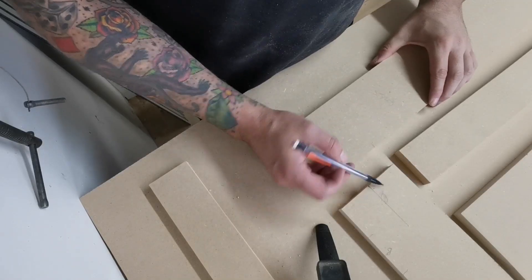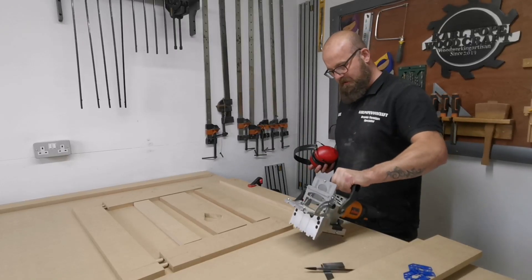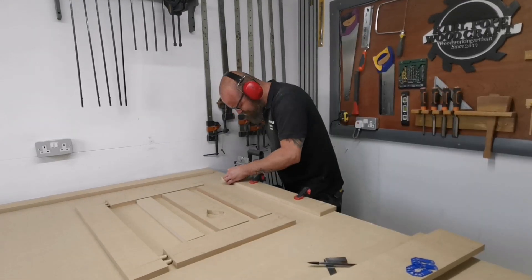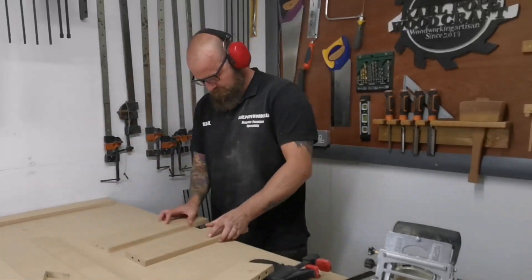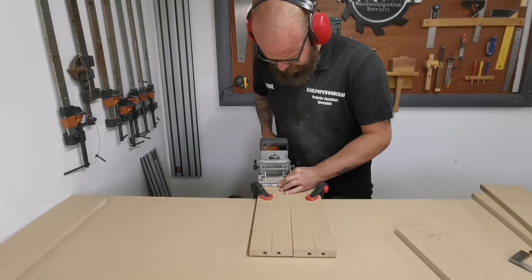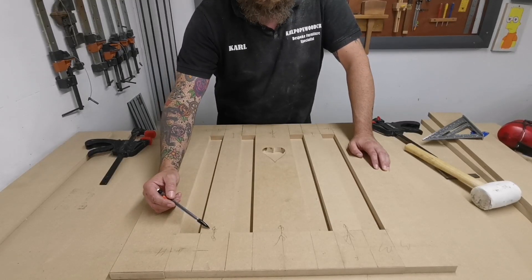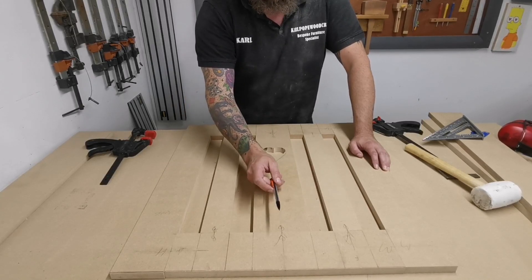Marking the corresponding dowel sections BB and AA at the other side. I've got this doweling jointer so I'm going to be using this, where you could use a normal doweling jig. And now for the centre rails - the bars - we've marked them BB for biscuits, because these don't need to be as strong. We've also marked the location, so we're going to go for zero biscuits in these two and 20s in the centres.